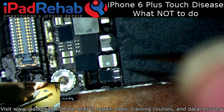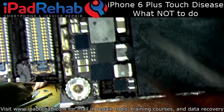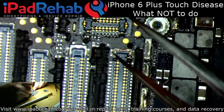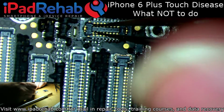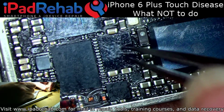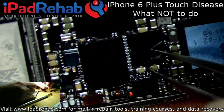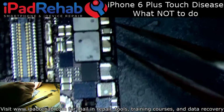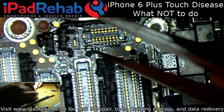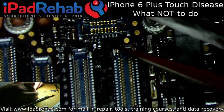So this undoubtedly happened. You know, this relatively minor overheating of the other side of the board undoubtedly happened while they were changing Cumulus, or apparently reballing Cumulus. I don't know. So it happened while they were working on Cumulus and just putting too much heat in this general area, which was totally unnecessary. I'm a little worried that they're uncovering these components over here, like maybe something was up with home button at some point.